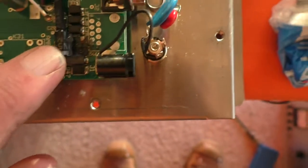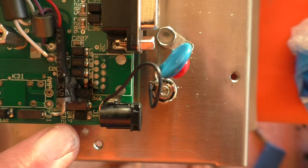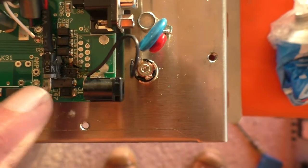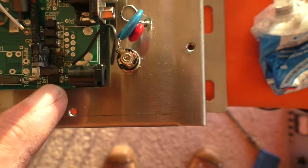There's a diode that I fitted there to replace diode D46. The cathode of that is soldered onto this little bit of print here — I just scraped off a bit of the varnish on the print and soldered it on there. So the cathode of D46 is now connected to the cathode of D47, which is how I think it was originally connected.